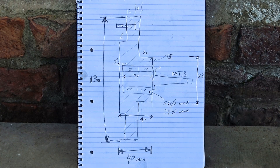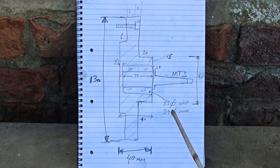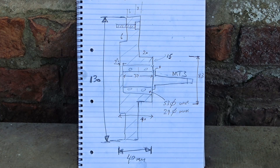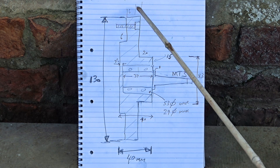Whilst the rapido's chewing the corners off, let's have a look at what a design might be. The backplate is 40 millimetres deep. The back of the chuck has got a recess in it, which is 6 millimetres deep approximately. The bearing is 53 large diameter, 29 inner diameter. I think I should probably have about 15 millimetres of metal either side of that bearing — so if the outer's 53, add 30, that's 83. So that collar size is about 83. The screw heads — cap head countersunk — are about 8 millimetres deep, so I reckon another 6 will be enough, making that 14 across there.